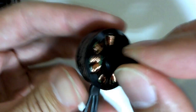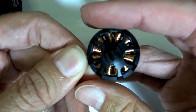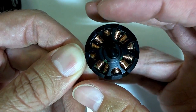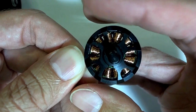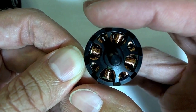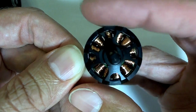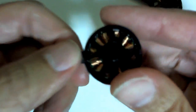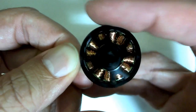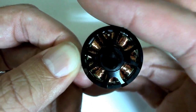That's about all we can see, I think, but if you were to hold these and do this, you would also notice that the fake motor has quite a strong stepping feeling, like it won't stay in some positions. It's always going to click around to another position, and that effect is quite pronounced in the fake motor here, whereas in the real motor it's nice and smooth. It still has a little bit of clicking effect, but not nearly as noticeable. Feels much smoother.